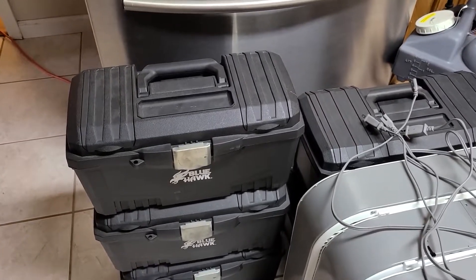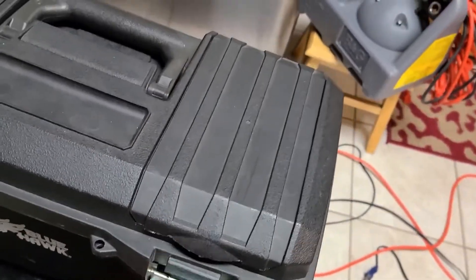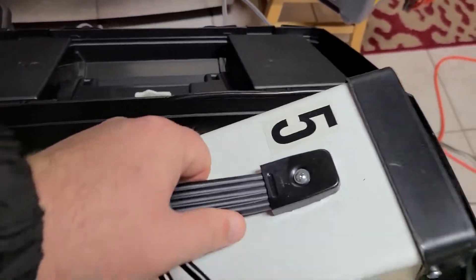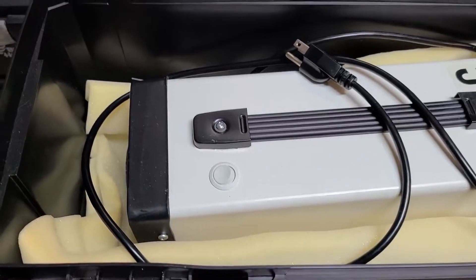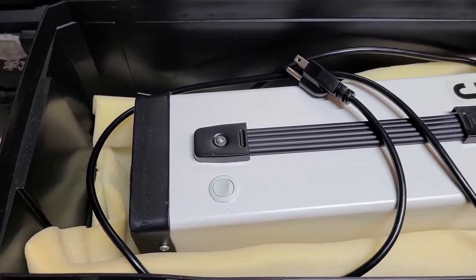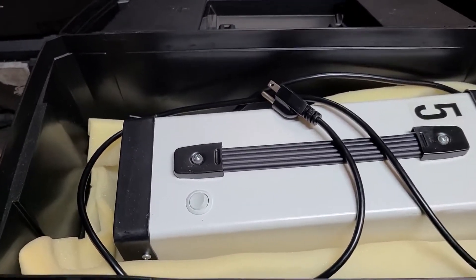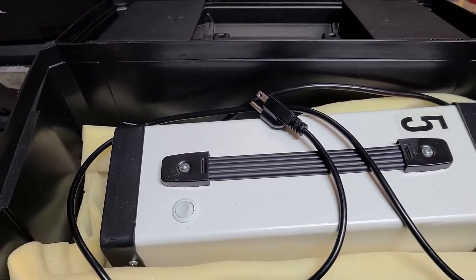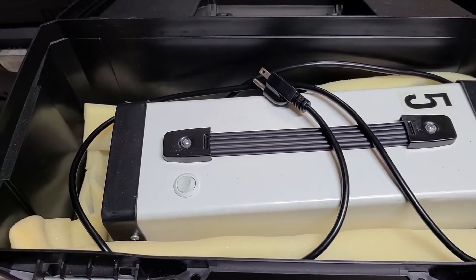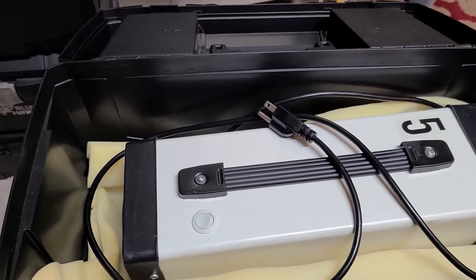For the types of machines I use, the first ones I ever purchased and still use are the Max Blaster brand. These machines have been real workhorses — they just keep working. What I like about them is they don't use the cheaper Chinese-type plates and transformers; they use very heavy-duty neon transformers and mica plates. People say mica plates are fragile, but I've had one fall out of an attic onto a hardwood floor and — other than a chipped corner — the machine still works. They're durable, reliable, almost no maintenance, and put out a ton of ozone. I highly recommend the Max Blasters.